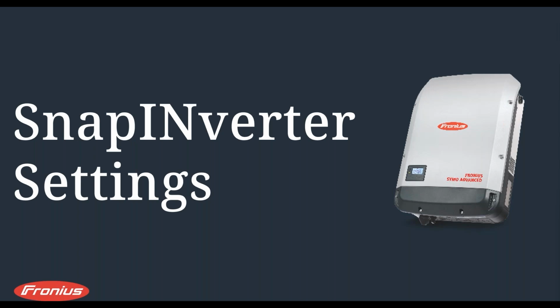And now I'm going to hand it over to Joel, and what he's going to do is show you how to do those settings for the slave inverters on SnapINverters, right? Remember, SnapINverters can't be a master inverter because they don't have a pilot monitoring card. They can only be slaves when we're talking about multi-inverter export control over the network. And yeah, I'll hand it over to Joel and he'll take you through that. Awesome, thanks Pat.